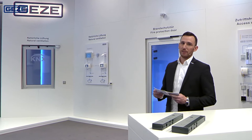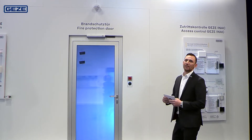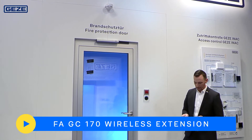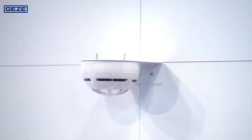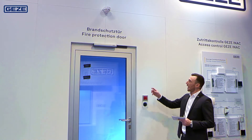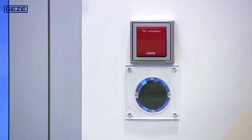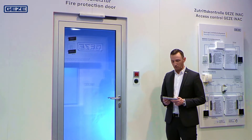Talking of cables, I would like to present a further additional accessory to the RSZ7 smoke switch control unit — our new FAGC 170 wireless extension. The wireless extension enables you to connect ceiling mounted detectors as well as manual trigger switches to the hold open system wirelessly. The system comprises the wireless input module seen here on the right next to the smoke control unit, the wireless ceiling mounted smoke detector, and the manual trigger switch with the corresponding wireless input module. This enables straightforward retrofitting of existing hold open systems.